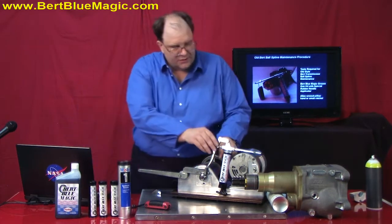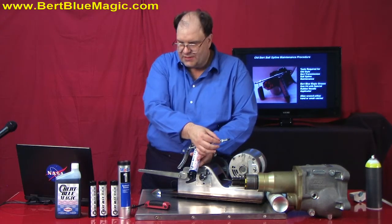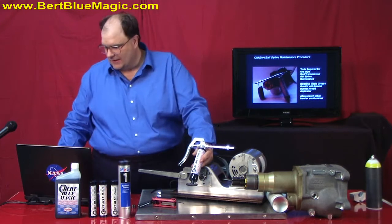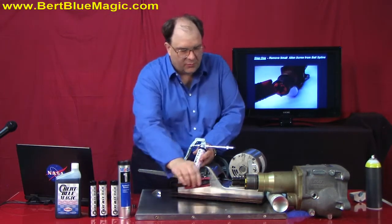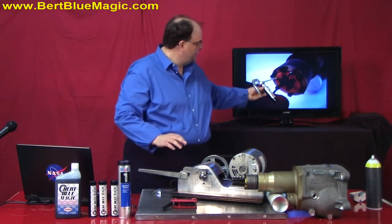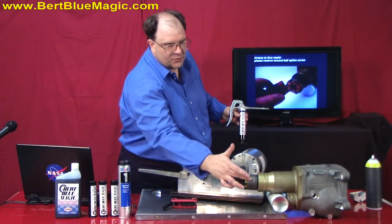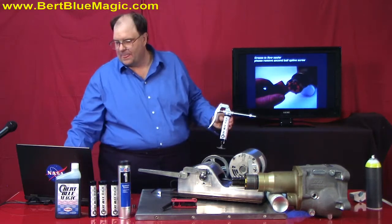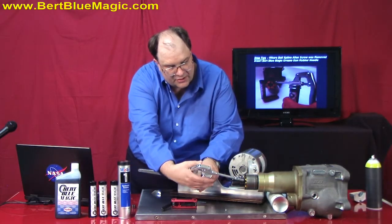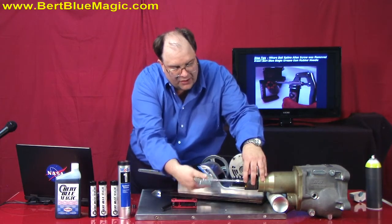The tools that we require: we designed a grease gun assembly, as you can see, with a special rubber-tipped end. You can either use your Allen wrench tool or maybe a quarter-inch ratchet with the right size end on it. Step one is the removal of the screw from the ball spline — we have a close-up in the presentation. Step two is you have to remove a second screw so that when the grease comes in and fills, it's able to come out. We have to be able to get in here, as we show in the presentation, to grease very well. The end seals in so no matter what angle you're at, it seals in.